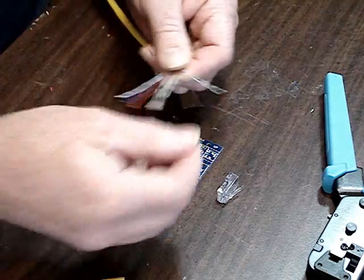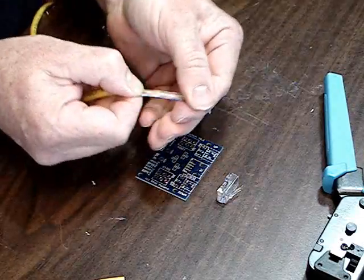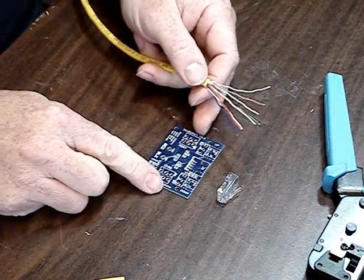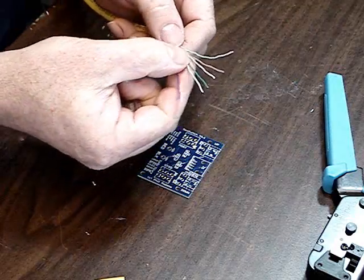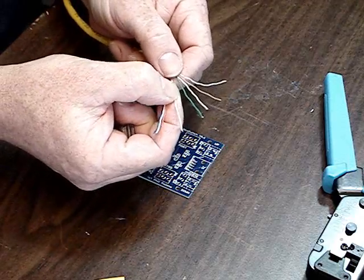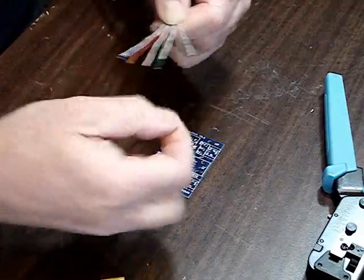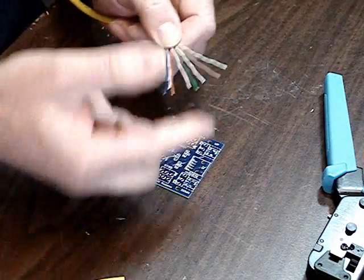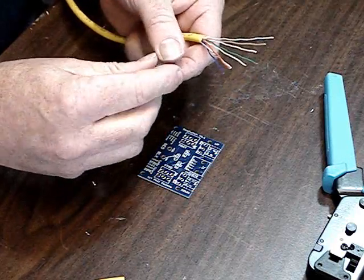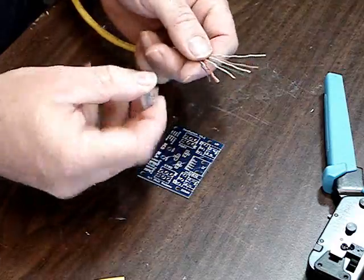Once we have these really straight, we can lay them out and now we're ready to put them in the right order. The C-switch and SeaPerch use an order of wires that is exactly the same as the most common ethernet cable. So if you learn this color code, it'll be very handy when you eventually have to fix an ethernet cable or make up a jumper cable. There are two types of wiring schemes — A and B — and we're using the B, which is the most common.